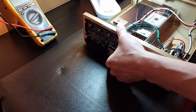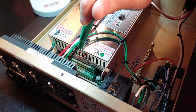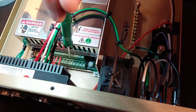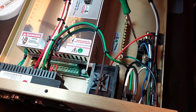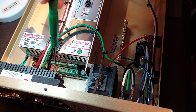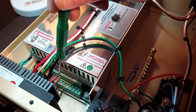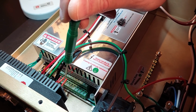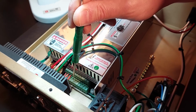I'm trying to move this so you can see the light. Now on the Rev 2 models, you can see the dual power output rails. Now why we're using the dual power output rails, being he's powering this relay at 48 volts, he would need an additional port there, typically because most power supplies that are not designed for CNC use run out of ports because they only have 3. And you're going to see that in the second half of this video.